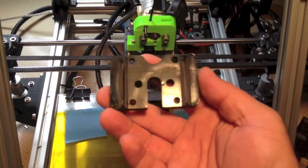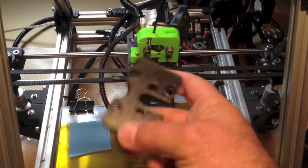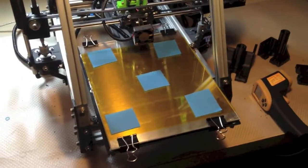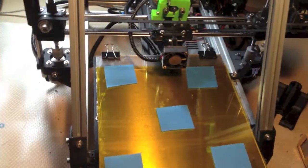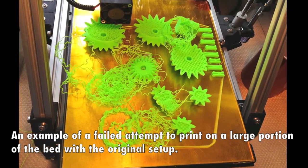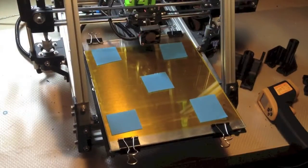I found a method that works and it's more or less set and forget. This is a clamp for the X-end — it goes underneath the rods. Good job, Trinity. Thank you very much — this really was a big improvement for my Mendel Max. I'm printing larger pieces and using more of the bed, and I'm just not having to worry so much about constantly leveling, re-leveling, and fiddling around with insulation trying to even out the heat on the bed.